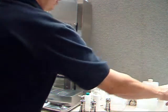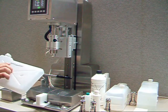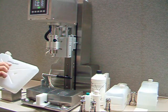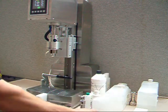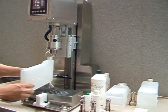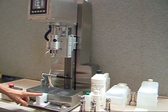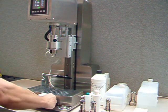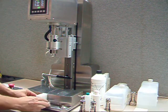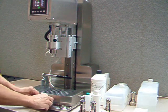I'm going to start the setup with this narrow container, identified by the number GP99225301. In order for these longer containers to perform well on the clamping table, we had to add this small block which supports the end of the container. This block may be removed if necessary, but I would recommend leaving it on the machine all the time.